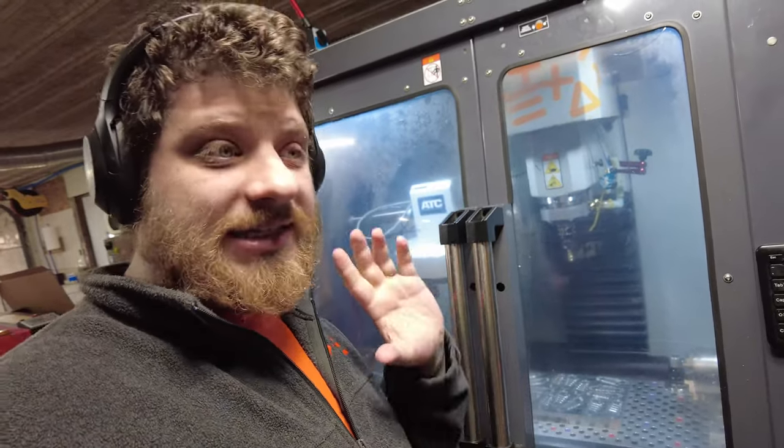I have one carabiner loaded up in there. We'll test that one by itself and if that works we'll move on to the rest. I just tweaked my CAM settings to work with the new tooling and oh my gosh, I underestimated how much time it was going to add to the production process. I remember why I use that other tool now — I'm going from two hours per pallet to eight hours per pallet. The mill sits idle most of the time so it's not adding extra cost, and it will remove all the sandblasting I have to do. I'm a little worried about tool life.